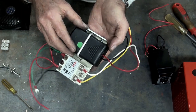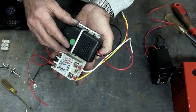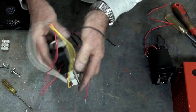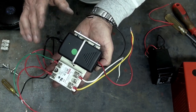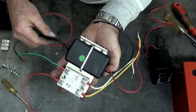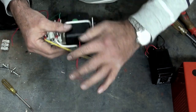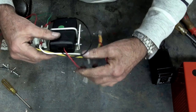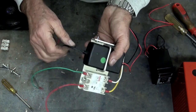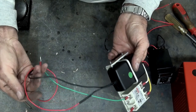For the power supply, I had a little 12 volt module which I think came out of one of those little power supplies for a laptop computer or something like that. It was all open and mounted on an aluminium heat sink. It just didn't have enough power to operate the relay, so this is a 24 volt one. I actually just left it in the case and put a U-bolt over that to hold it all down. I figured I'd rather have that with secondary insulation around it — just made a nice neat package. All I did was where the original plug went in, I knocked the pins out and soldered these wires directly to the circuit board inside and simply passed them out through the holes in the casing.